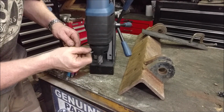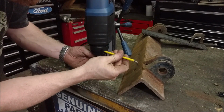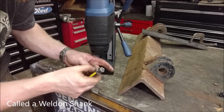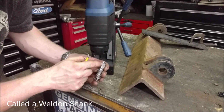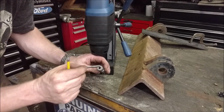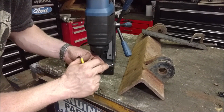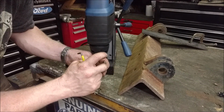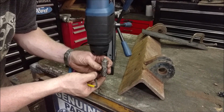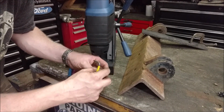To change a bit, it might be a little different than you're used to, because it's a 3/4 inch machined bore with 2 flats on it. So it's 2 machined flats, and this is exactly 3/4 of an inch. And you've got a little center plunger, and there's a spring up in there. I don't know if you can see, there's one little flat on one side. So when this is down, the coolant just pools up on here, and when it gets pushed up, the little flat allows coolant to flow from the inside out.